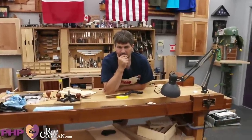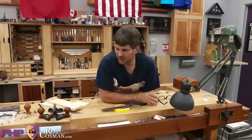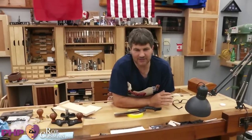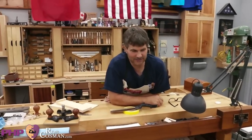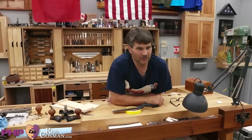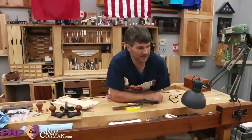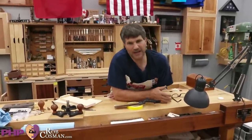Okay. John Kasarowski. Hi, John. John's out in Florida, right? I think so. What inexpensive wood would you recommend for practicing as a new hand tool user? Oh, well, if you lived around here, northern white pine is beautiful wood to work. It saws nicely, it planes nicely, it chisels nicely, it just does everything nicely. It's just a beautiful, warm wood. Don't mix that up with southern yellow pine. That'll beat you up. Probably basswood.